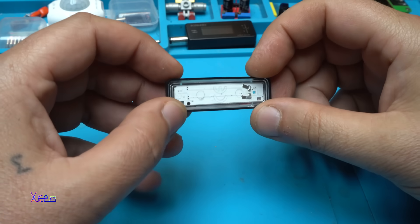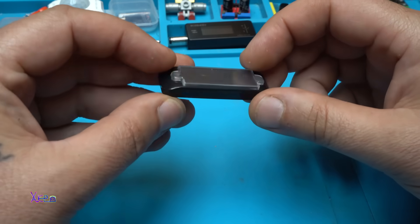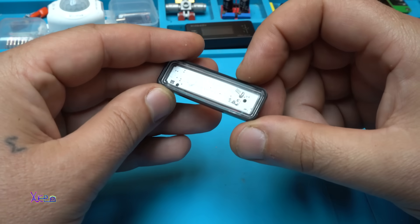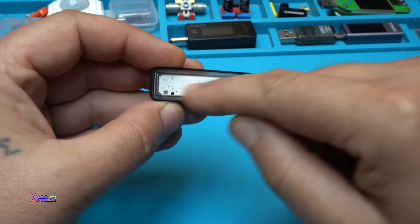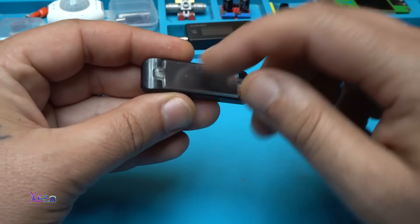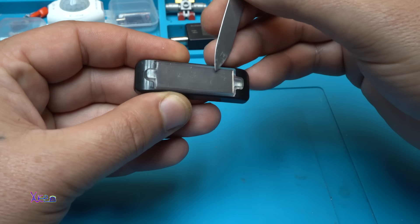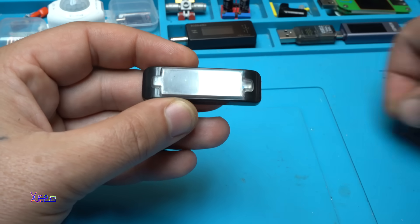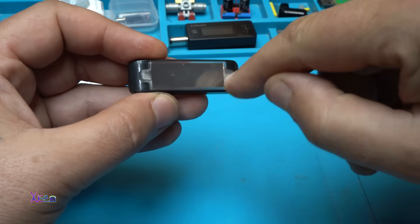The description says it has a built-in lithium battery inside, but it doesn't say how many milliamp-hours. It's waterproof — I can see the printed circuit board and two soldering points for the battery. On top we have the solar panel: one, two, three, four, five, six, seven, eight, nine cells — nine times 0.5 volts is 4.5 volts, enough to charge the lithium battery. And it has two green LEDs.